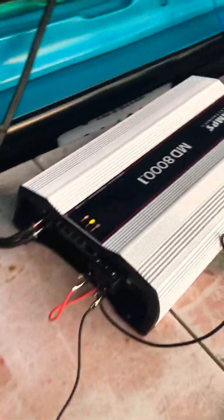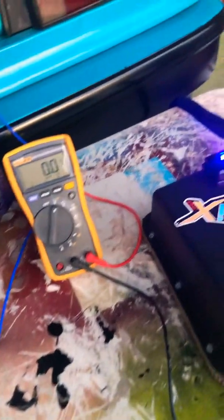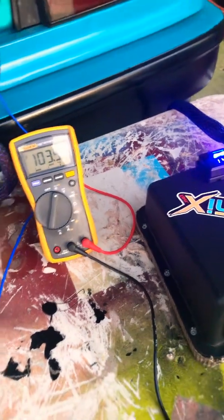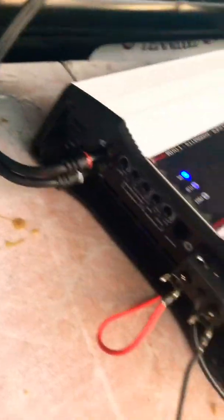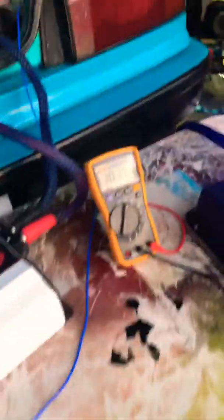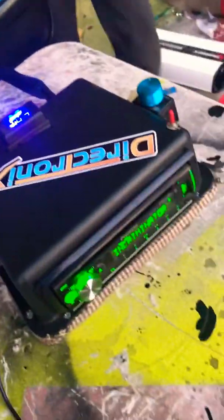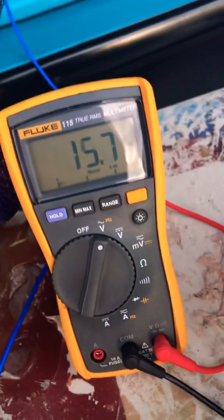As you can see, she turns on at about 105 volts. So what we're gonna do is take our gain far left where it says level, and we're gonna move it around until we reach that point. You want to keep the frequency the same and everything else the same. The voltmeter — AC voltage — just like how we had in one of the last videos.